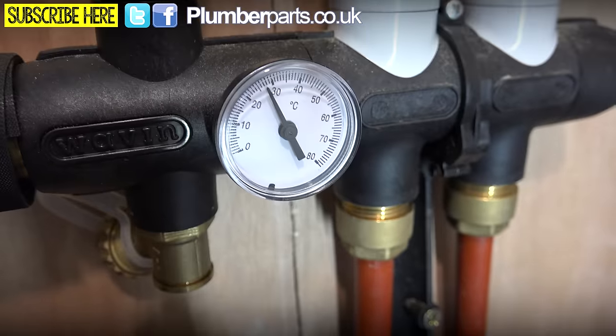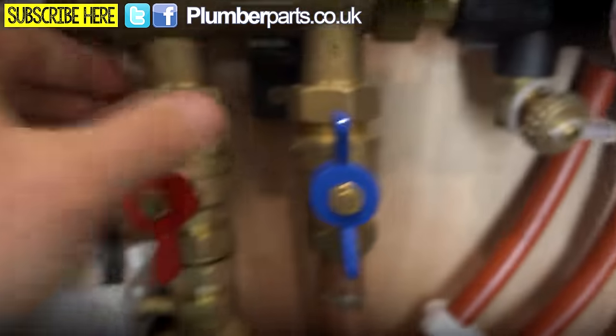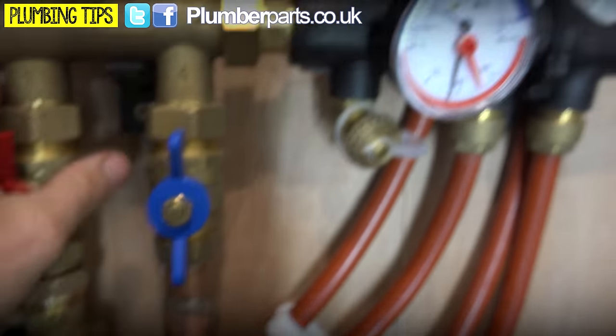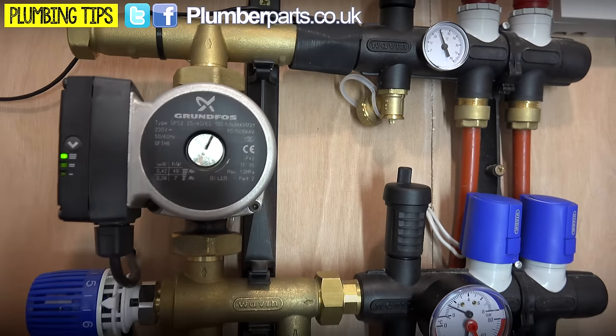And also our temperature is still hovering at a very sort of lackluster late 20 degrees C. If I feel the pipe that's here, there's not a lot of heat coming through yet from the boiler because these haven't fully opened up yet. So at the moment, the system's still dormant. You're not going to feel loads of hot water coming through here straight away.